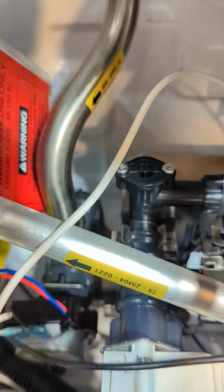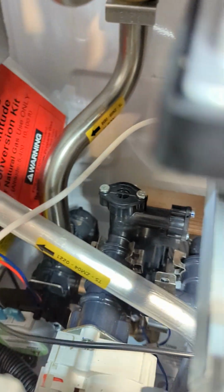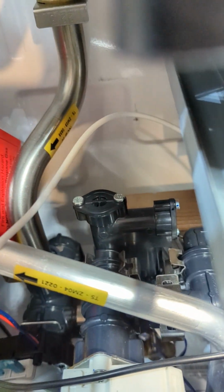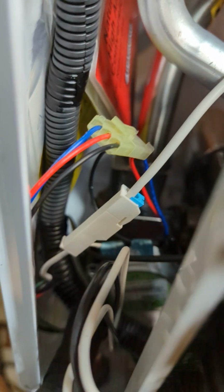With these new models, there's a switch right there. That's the three-way valve right there. You're switching it from going down to the bottom over there, or going to this heat exchanger. When this three-way valve is not working right, or it's stuck in one position, that's why you have either hot water only or heating side only. And that's the part that we're going to change.